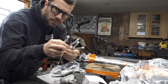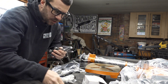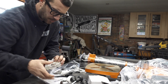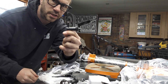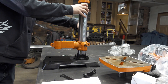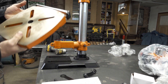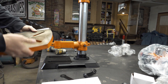There are three longer handles and one shorter handle. The shorter one goes for the speed control; the other goes for the up-and-down mechanism for the drill. It says it's a 5/8 chuck — things pretty beastly, definitely bigger than my half-inch, which is nice. There's a 16mm socket for the table, and the table is removable, which is nice.